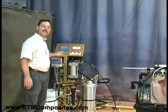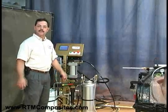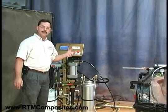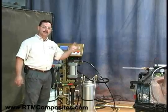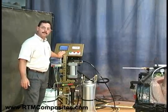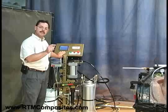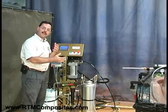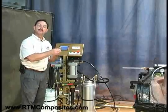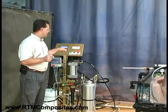It's a feature set built from history — nearly 70 years of combined experience. I've been in this since the late 70s, and I've had numerous opportunities to think about what the machine should do. All of those ideas are built into the PRG. It is a fully automatic, PLC-controlled machine — close to the emulation of thermoplastic injection molding. Just as in thermoplastic injection molding, we can control the profile of the injection, flow rates, and pressures. We can step those rates and pressures and create a profile in a recipe when running automatically. Today we're going to inject manually.